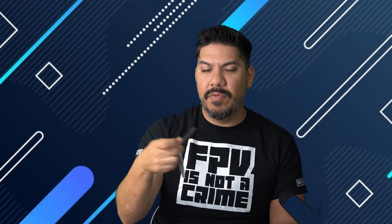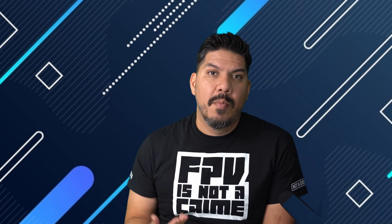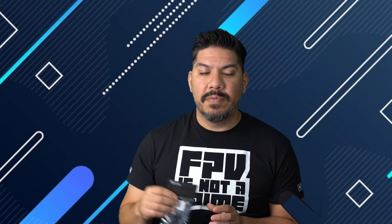The next thing is connectors, which allow you to plug and play. Pretty much every flight controller is going to have at least one connector for your electronic speed controller. This Skystars flight controller actually comes with a number of plug options so you can wire up your own connection to a number of ESCs. Other options include plugs for the receiver, video transmitter, and analog camera. Special features can include the floating gyro in the Kakute series, or on this Skystars, the gyro is isolated from noise on the board for a cleaner signal. The FPV community prefers the MPU 6000 gyro, which seems to give the most consistent performance and is on most of these units.